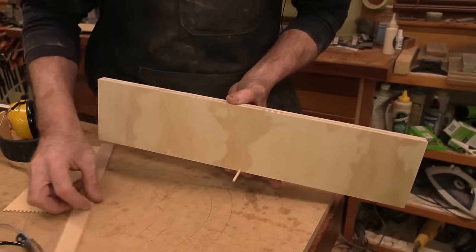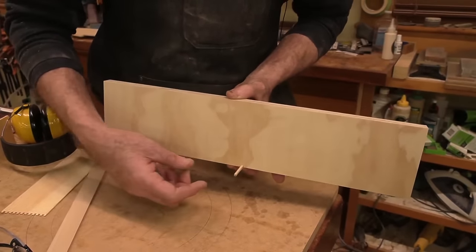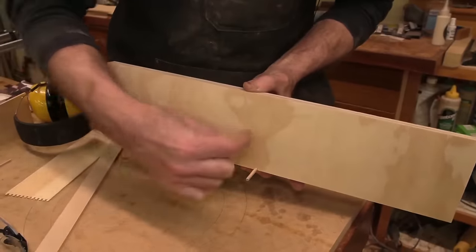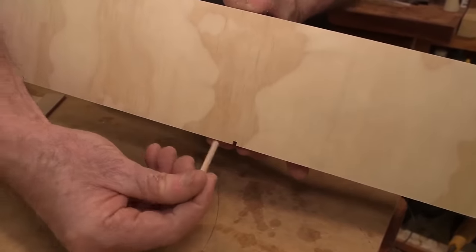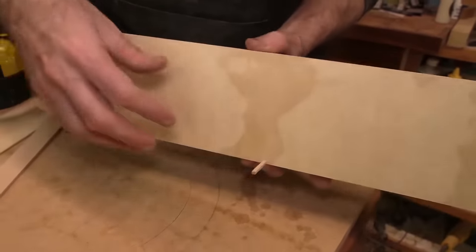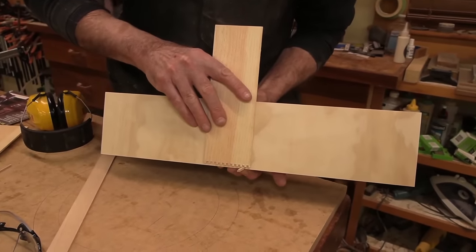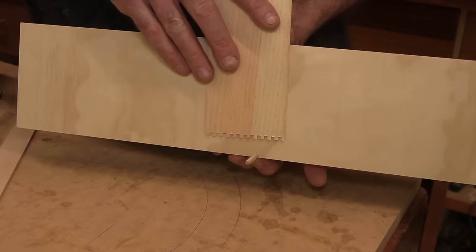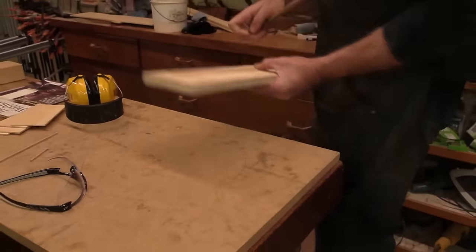So just imagine, no matter what kind of pins you're going to make, you might have larger material, you might be using plywood or something like that, set up your dado cutter, because you may go thicker because you need to get it in just one pass, and you'll make a groove just like that, whatever size it is. Then you're going to size your stock to the width of that, and that's going to become your indexing pin. Then I would just glue that in, and that would be the indexing pin for me here, because when I'm cutting these teeth, it's going to rest over and I'll cut each one referencing off that pin. But let me show you how that is, because it's a little confusing until you see it, I think.